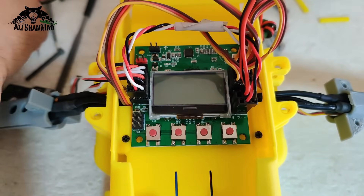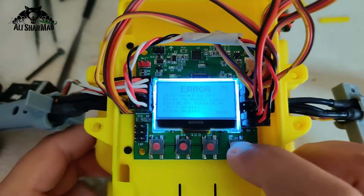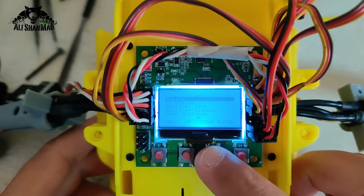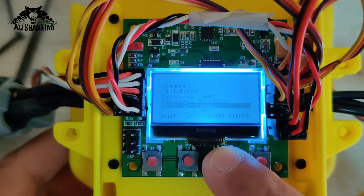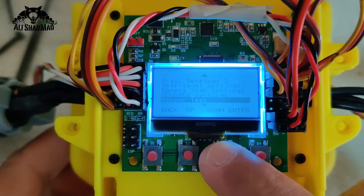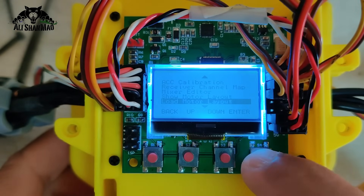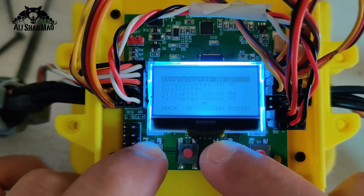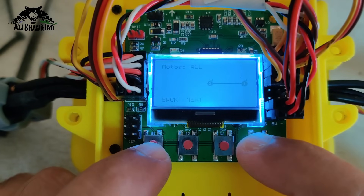Let's start with the KK board configuration — Bismillahirrahim, powering it on. The first thing we're going to do is choose the layout of the motors for our aircraft. I'm going to go to 'Load Motor Layout.' It shows single copter first — you will need 'Dual Copter,' the third option. Click on it and say yes.